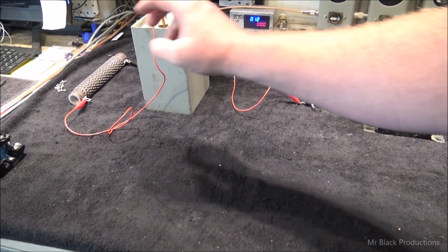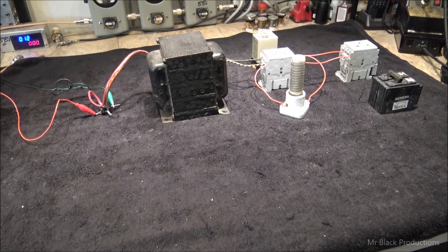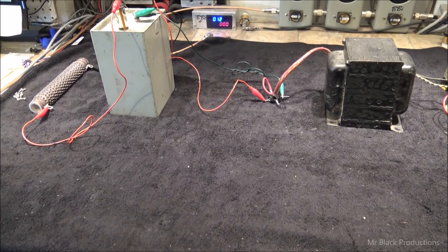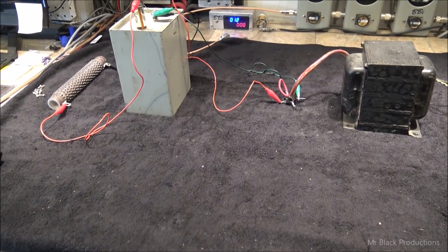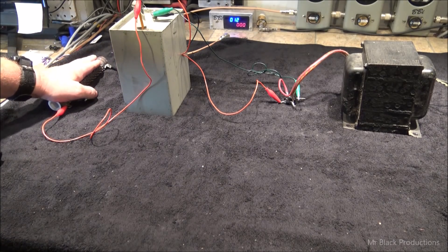With the high voltage capacitor and the bleeder bar that's present. I'm not going to say resistances or values of any kind because everything is variable. But the physical operation of a soft start circuit comes down to those three parts. Let's look at it from the top down — from the finished product, which is post-rectified, filtered, ready for us to do something with it. And this passive circuit that sits here and saves your life — which is your bleeder.